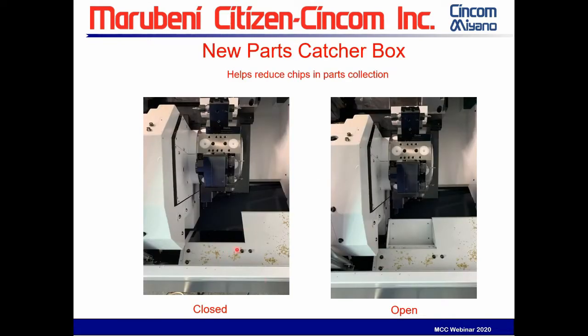We've changed the parts catcher a little bit to help keep parts cleaner and keep chips from getting in there. So you see now here, it's closed during machine operation, and only opens up when you want to drop a part in the parts catcher. This keeps a lot of chips from getting into the basket, so you don't have as big a mess to separate.